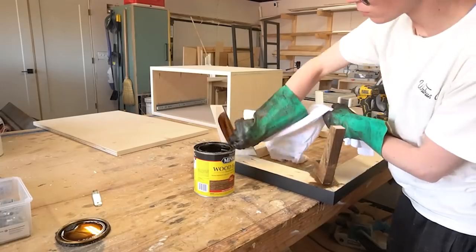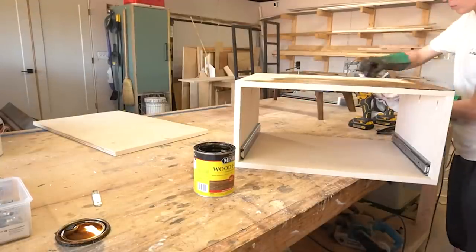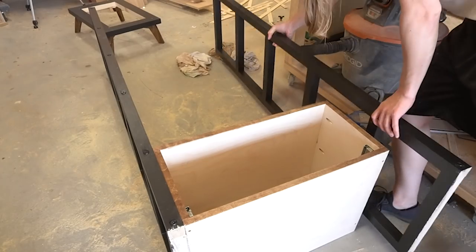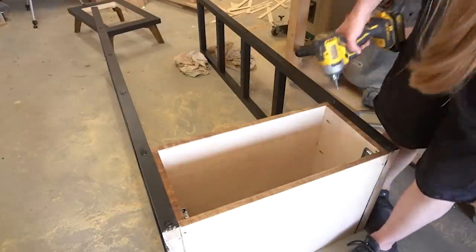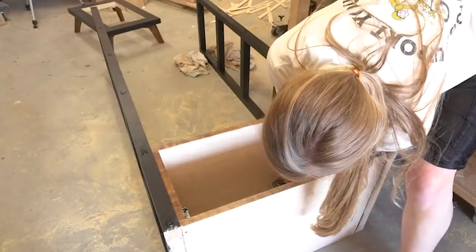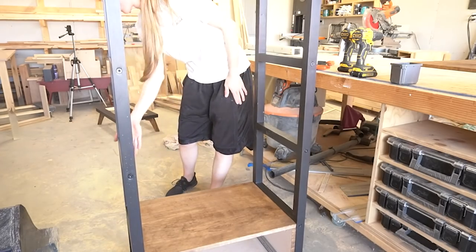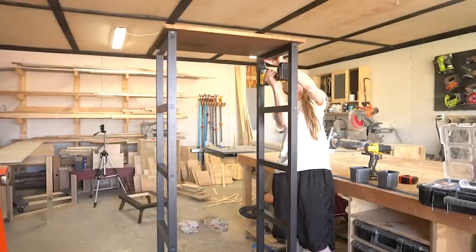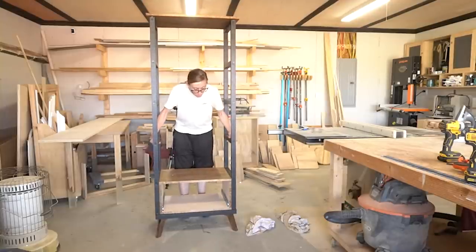At this point I was ready to start putting everything together, but I went ahead and stained the top, the legs, and the box first to make things a little easier. Another takeaway looking back is that it would have been so much easier if I had not done this whole two-tone thing, but it is what it is. Once these pieces were stained, I laid them on the floor and used wood screws through the drawer box to attach the frame to each side, then attached the top through the frame using 2-inch wood screws with one inch of overhang on the sides and front. Finally, I placed it on the base and used wood screws through the drawer box to secure it to the base frame.